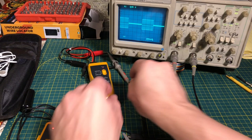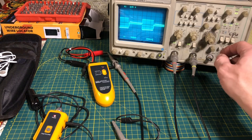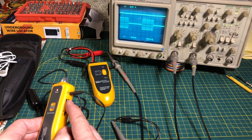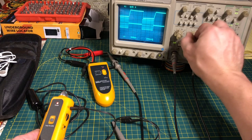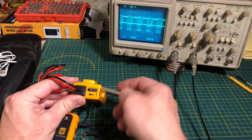Here is rather an extreme example of amplitude modulation because the base frequency is completely cut off between cycles. We will use a piece of audio cable with a 3.5 mm jack to take readings from the receiver side. As expected, the receiver output signal follows what is being transmitted — we get a heavily clipped 0.78 volt sine wave with the exact same frequency as modulated by the transmitter.